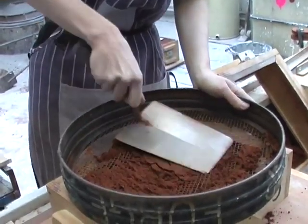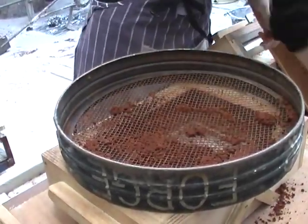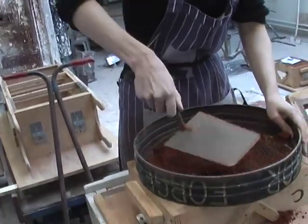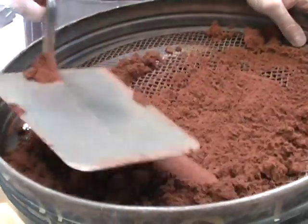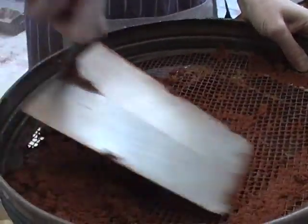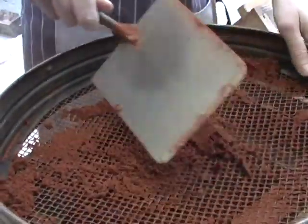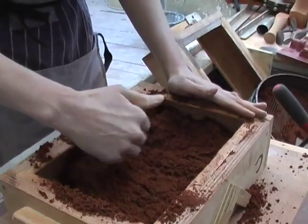The first layer of sand is usually sieved, so that the pattern isn't going to be damaged by any lumps, any objects like bits of stone, screws or whatever. We're getting the best quality sand around the pattern to begin with — just a covering. And that will enable as much detail as possible to be imprinted in the mould surface.